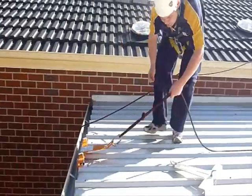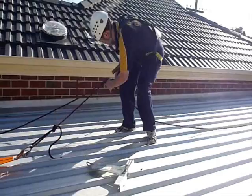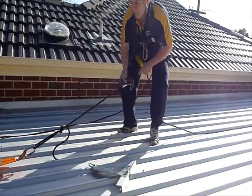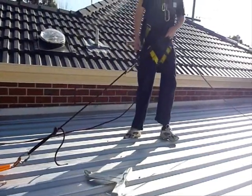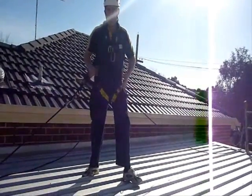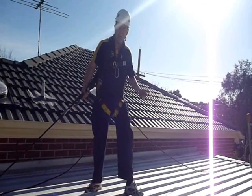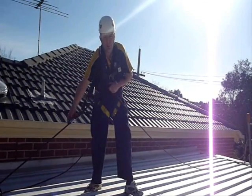I'll move away from the edge. With my T-bar in this position, I've now completely set up to work on the opposite side of the roof. The T-bar is only useful to secure a man who is working on the opposite side of the roof to where the T-bar is positioned in the gutter.